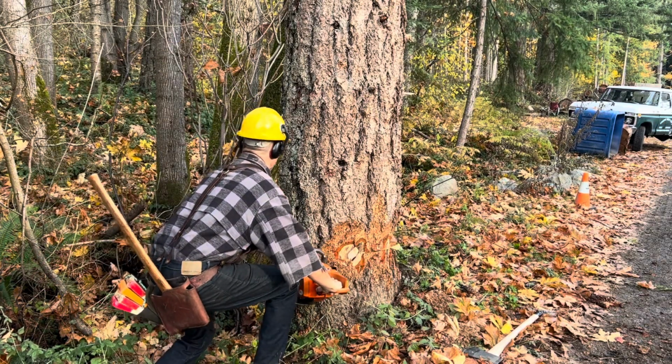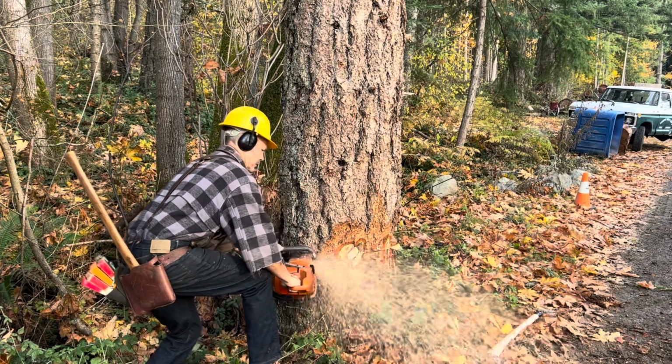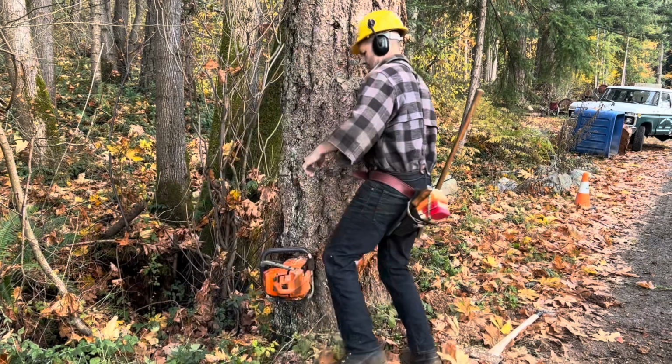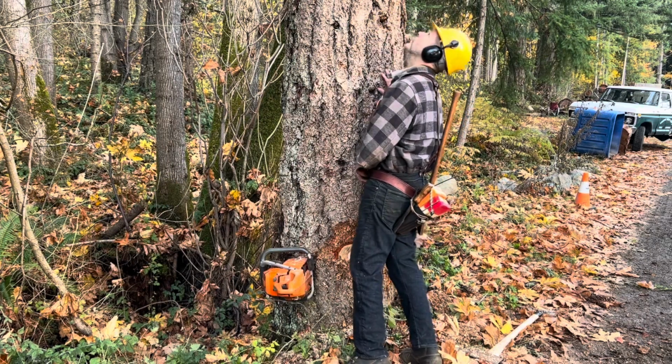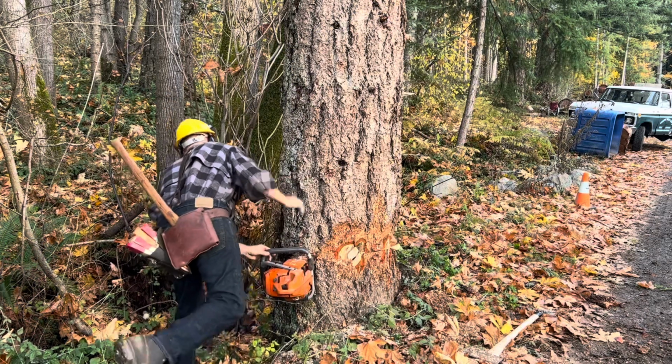Friends, notice how smooth the saw is on a straight cut like this. But when you throw the undercut in, your dogs grab unevenly, and you'll notice. Watch. Just listen to the saw on the undercut. This is why it's so important to have your raker set. Listen here.